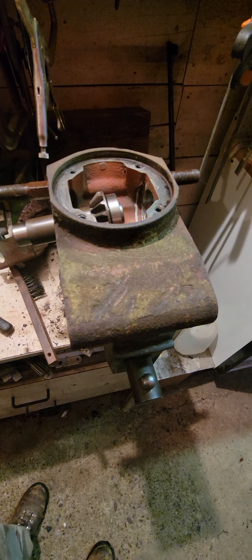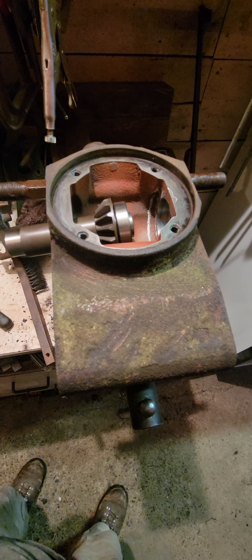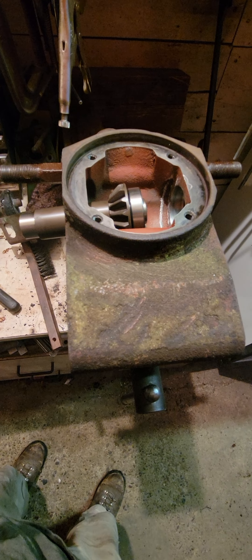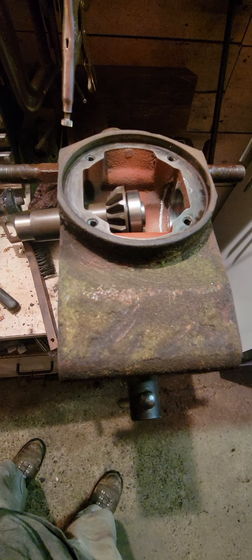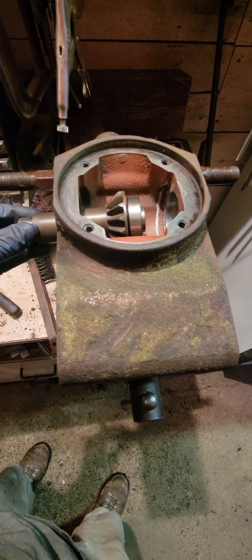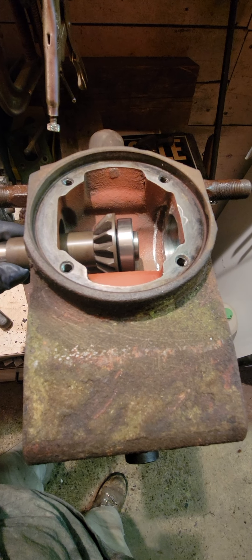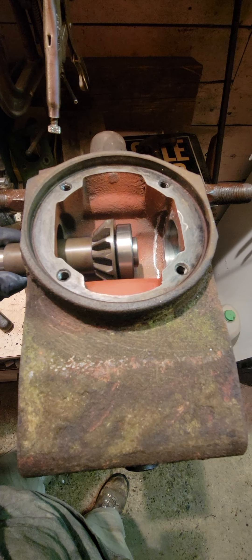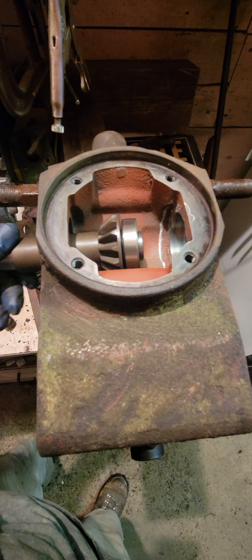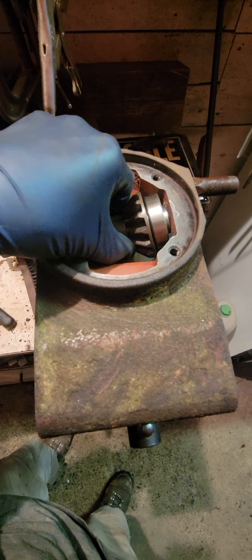I'm working on a new idea 5212 pod from the cutter bar. If you're watching this video you probably already know how to get these apart, so I'm not going to go over that. What I'm going to go over is basically how to get these new gear sets put in and adjust for the correct clearance — the lash on the gears.